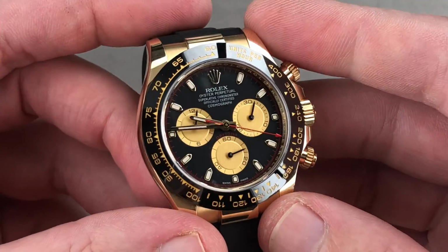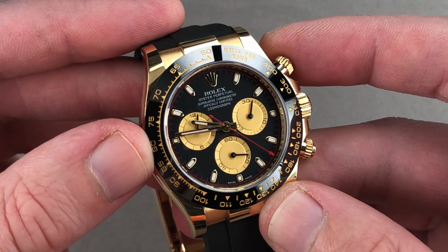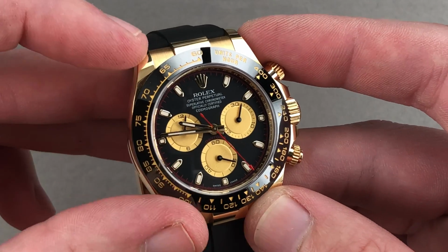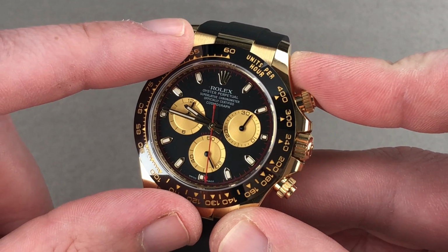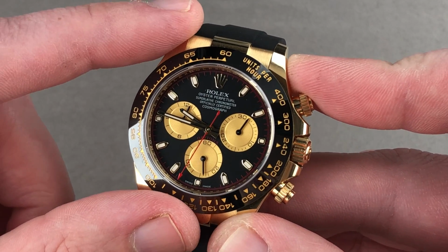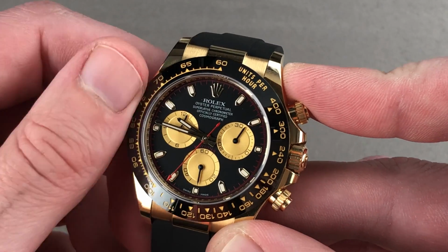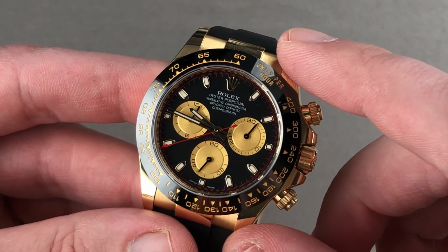What's inside? Rolex caliber 4130, a manufacture movement introduced in 2000, 44 jewels, bidirectional automatic winding for smoothness. It was the first Rolex movement to use a bearing instead of a jeweled staff for the rotor, so it's more shock resistant. A full balance bridge and a free-sprung index make it even more shock resistant. It has a 72-hour power reserve, and it's been adjusted so that it meets the COSC standard.